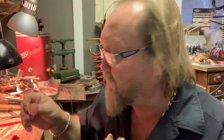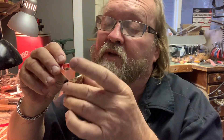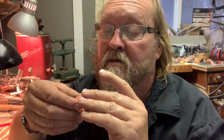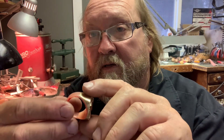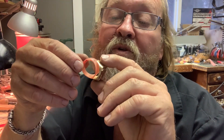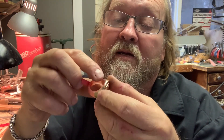So I took some wax, wrapped the wax around the mandrel, and then I bent this out a little bit so that it would fit on there. I'm only going to go one way. Literally look at that — how it just flops in. So I'm going to cast this, and then once I tumble it a little bit, it's just going to pop on there like that. It really will.